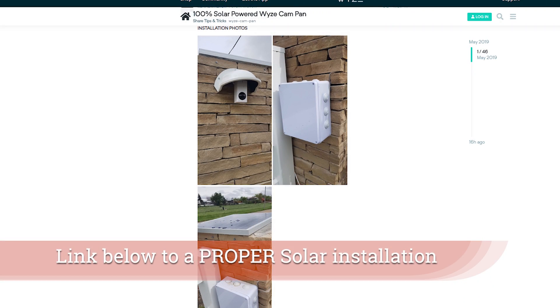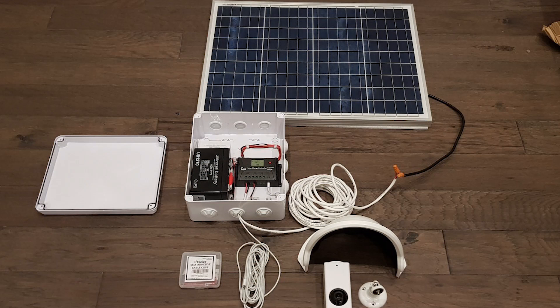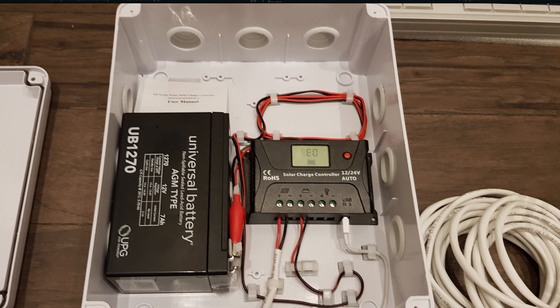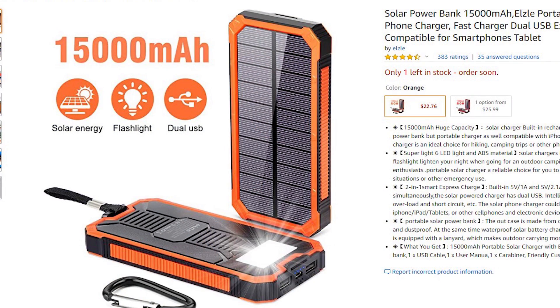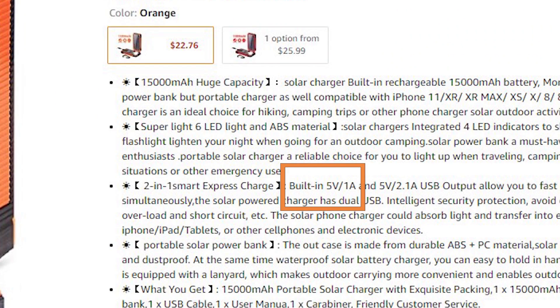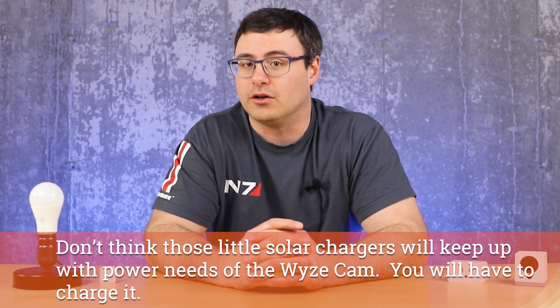This means you can attach it to battery power. Before you ask about solar installations — you can do it, but the panels are quite large and the installation is quite large as well. I'll leave a link below to one of the only installations I saw that met the code requirements. When dealing with solar and batteries, you have to have regulation of the charging and discharge. For a battery pack, it's actually something really easy to do, and you can do a very simple calculation with that 2-watt maximum for how long you'd get out of any battery pack before having to recharge it.